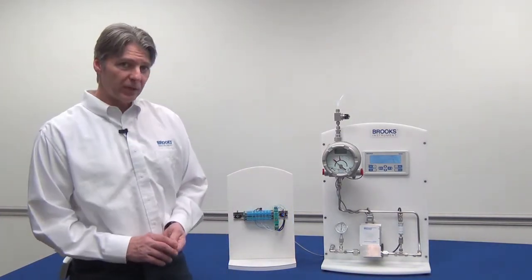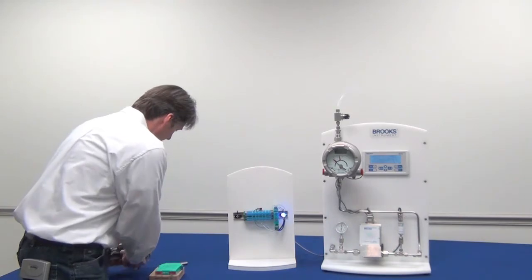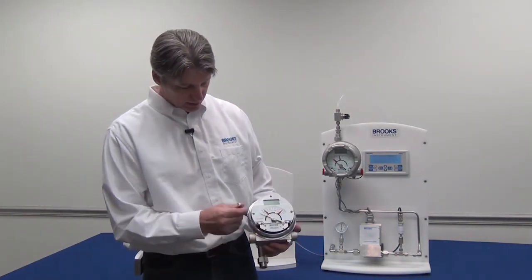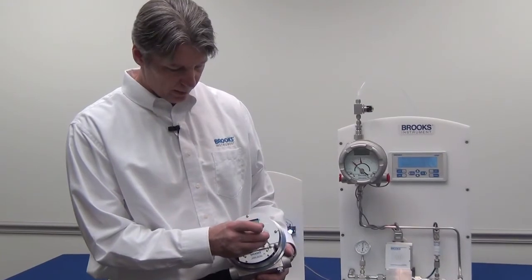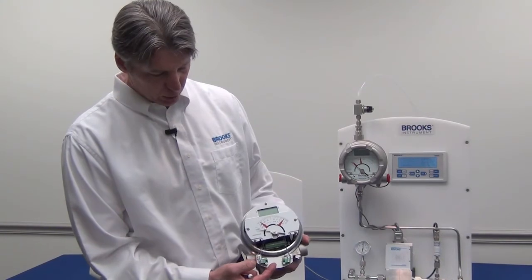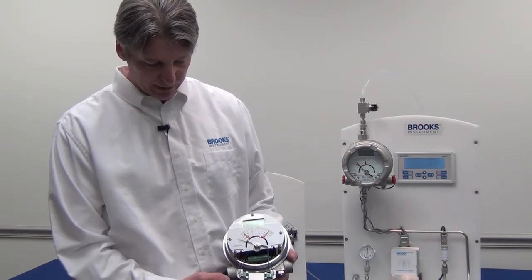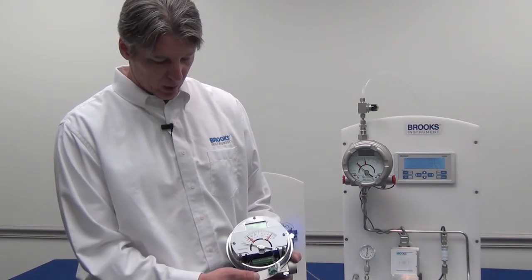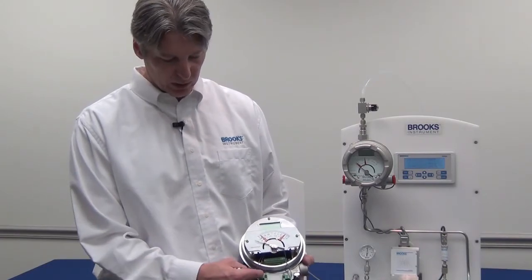For wiring, internally the inductive sensors come pre-wired to the terminals. Your 3809 with alarms has a terminal that is pre-wired with a blue and brown wire to each of the relays or sensors. These are polarity sensitive, so the brown wire is your positive and the blue is the negative. You're going to field wire your amplifier relay to these terminals.